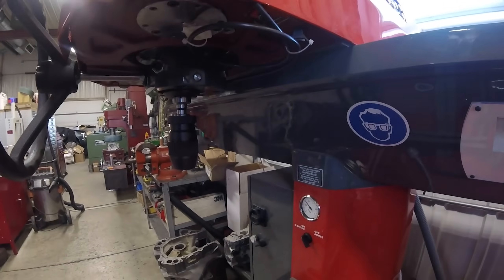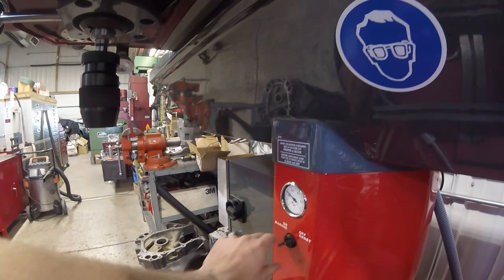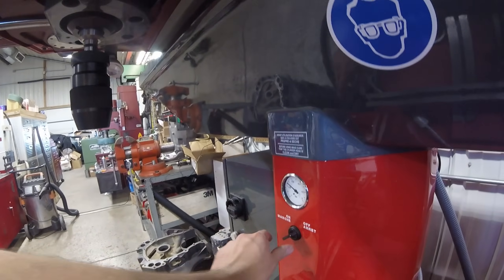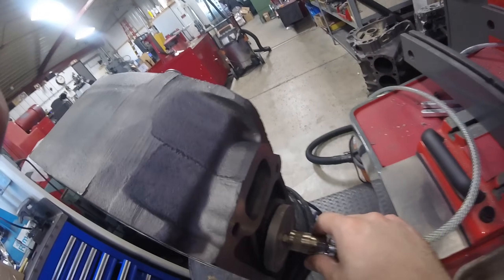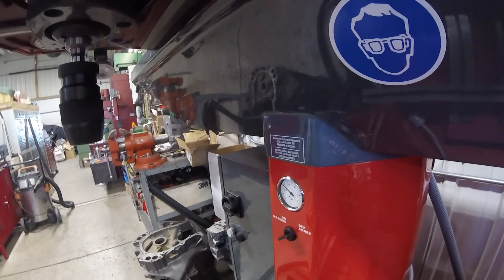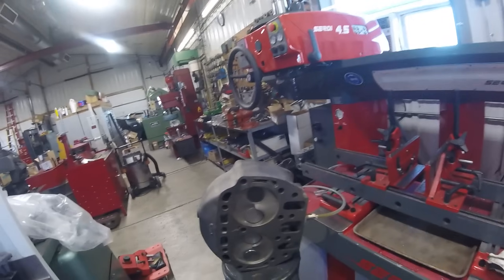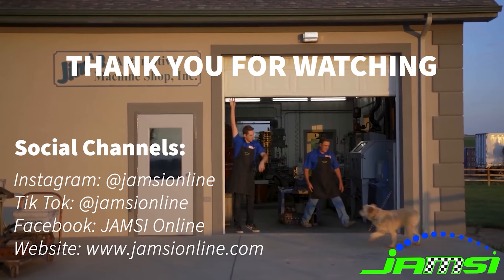This is the other exhaust valve — it takes a while to pull that much air out of there, but when I turn it off the needle doesn't move. If there was something wrong with this it would leak down almost instantly. The last check is the intake port for both intake valves. It's pulling good vacuum and when I turn it off, it stays put. That's what a finished remanufactured John Deere A cylinder head looks like. If you made it this far, I want to say a big thank you for watching.